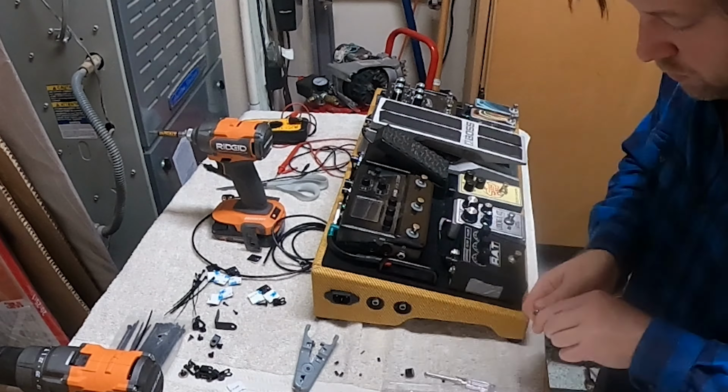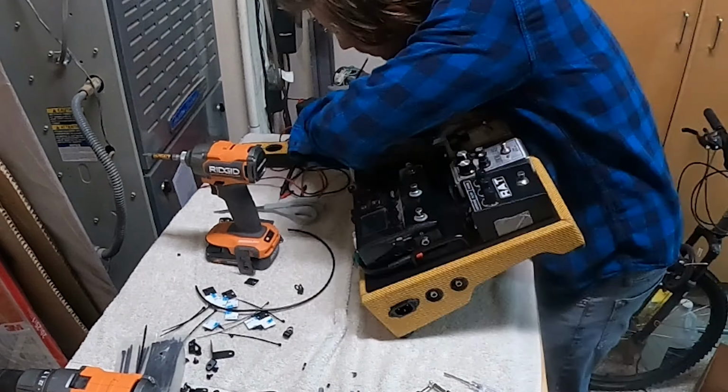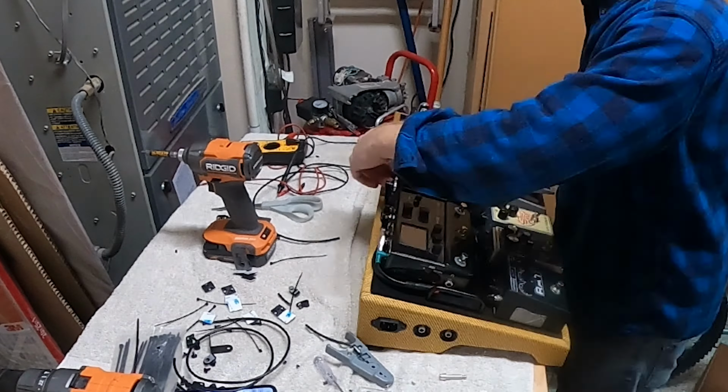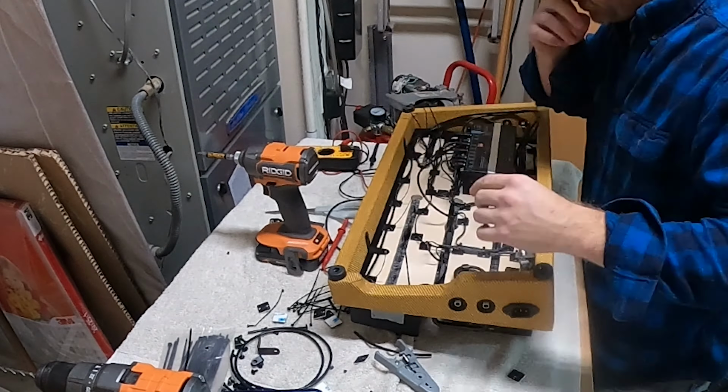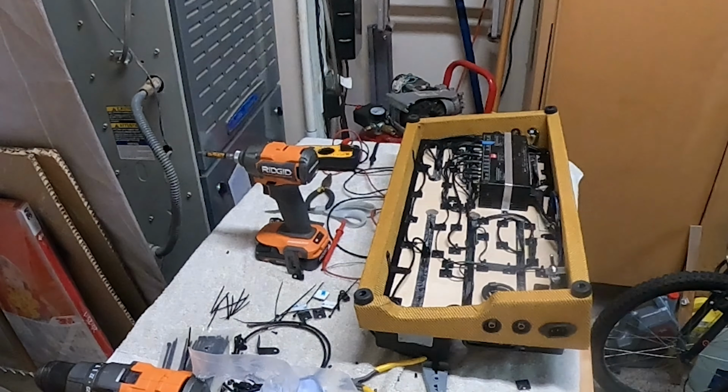For me, the best way to get the actual length of cable that I need is just to snake the cable with no ends through the board, roughly following the route I intend on routing the cable, and then I cut it to length, snake it back out, and put the connectors on.